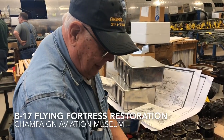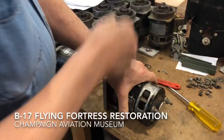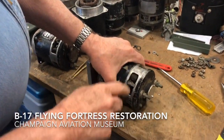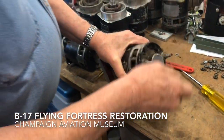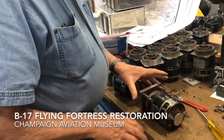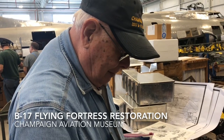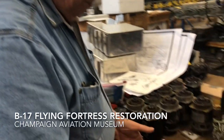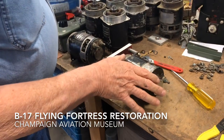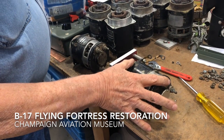My grandson and I, what we've done is disassembled this motor — all these motors — and cleaned the commutator up, cleaned the bearings out, and repacked the bearings, and tested it before we did all that with an ohmmeter. And everything — these are very rugged motors. They're used about everywhere on the B-17 bomber and other aircraft too, I think, during World War II.